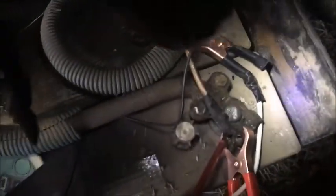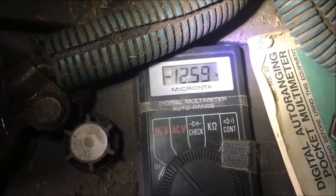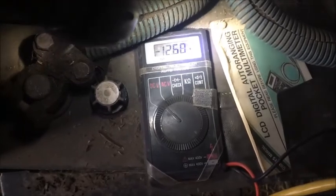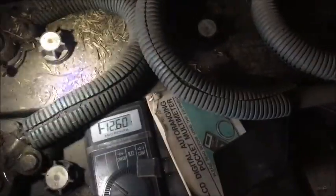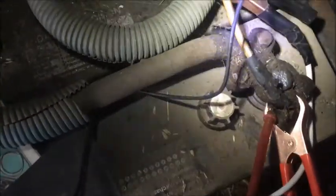Here's my setup. Ran it all the way over here to these 6-volt batteries hooked in series. The charge is going up a little bit — started at 12.54, now I'm up to 12.6. I bet I come back tomorrow and it'll be nice. When a fully charged battery comes off a charger, you're at 13.5 volts at least. You've got to be at least 12.4 to 12.5 volts to start a tractor. If your 12-volt battery reads 12 volts, you're basically at a dead battery — about 50% capacity — because each tenth of a volt drop is a logarithmic relationship; it's actually a lot more voltage drop than just one tenth.